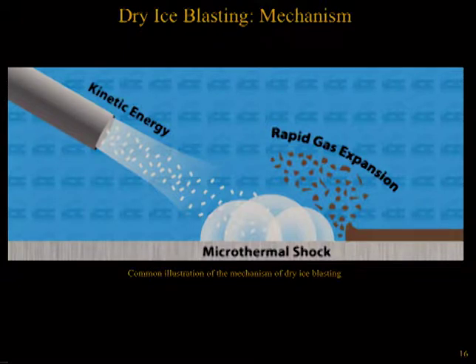Research has shown that the thermal and gas expansion effects play little or no part in the overall cleaning power of dry ice blasting, and that the kinetic effect is the true driving force behind the process. The kinetic effect relates to the impact strength of the dry ice particles hitting the material to be removed—the stronger the collision, the greater ability to break up the surface debris and coating. This cleaning ability is tied directly to the velocity at which the dry ice particles are traveling and the size and number of particles in the system. Velocity is controlled by the supplied air pressure, denoted in pounds per square inch. The faster and straighter the dry ice particles move, the stronger the impact. Conditions that affect velocity are working distance, blasting angle, or anything else that changes the direction of the media stream. For particle size, the larger the mass of the blasting media, the greater the impact.